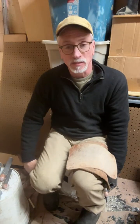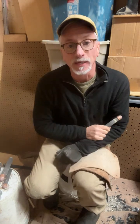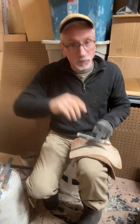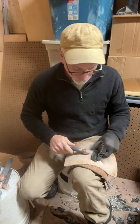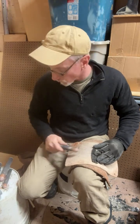But eye protection, super important. Tuck your pants into your boots. Have some sort of pad. A glove if you can tolerate it. And the other thing is, you should be doing this in a well-ventilated area if you practice a lot. The dust that comes off from this is silica dust. If you do this in an unventilated area for a long time, you can develop silicosis, which is an awful thing, not something you want. So those are the things: eye protection, hand protection, good ventilation. Just know you're assuming some risk if you do it at all. There's just no getting around it. There isn't an entirely safe way to go about doing this.